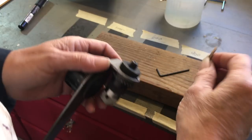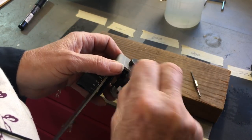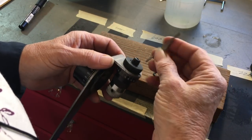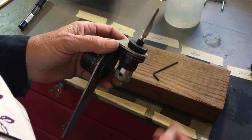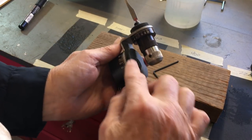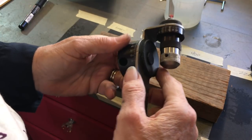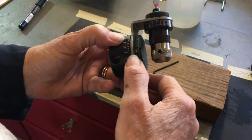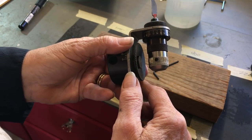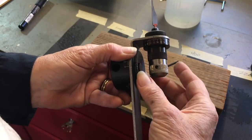Now you're going to insert — you want to make sure that your set screw is out enough to allow the graver to go into this area right here. Put it in, but don't tighten it at this point. Next, there's a knob here that needs to be loosened up. This also has a mark on the metal right there, and you want to set that to zero. Just hold the two pieces together and then tighten the wheel down.